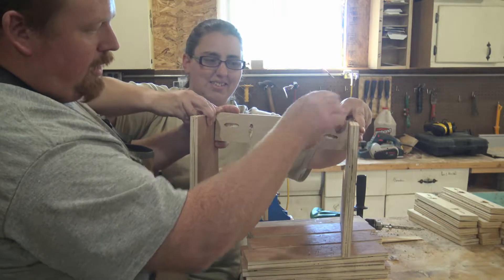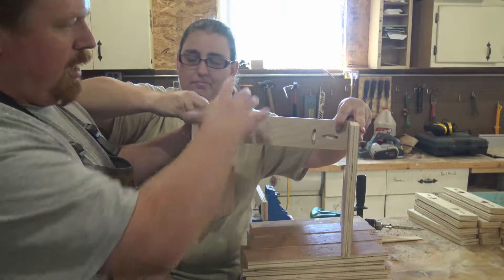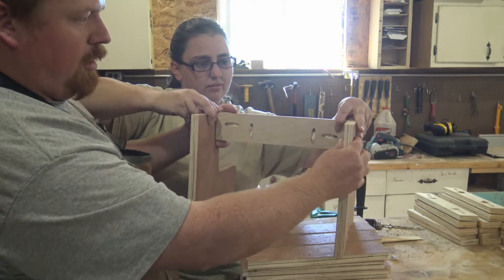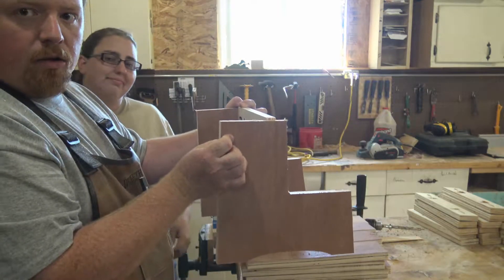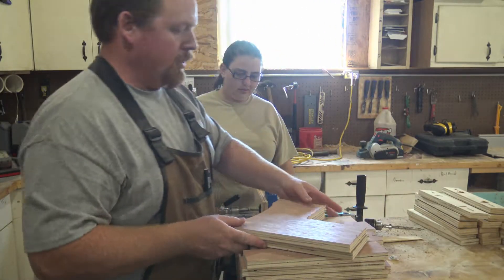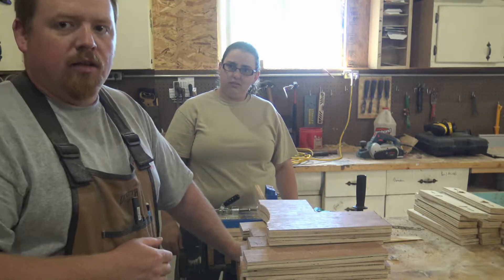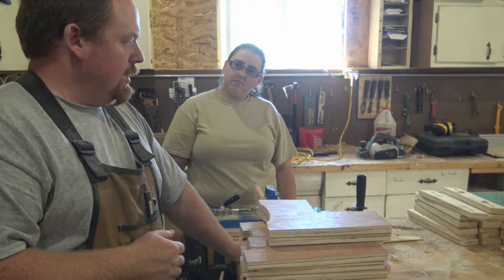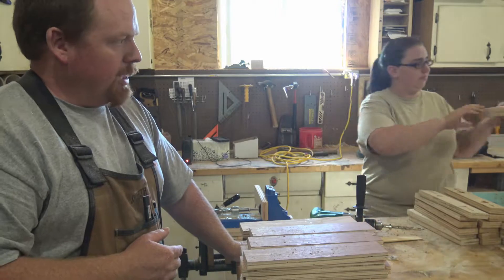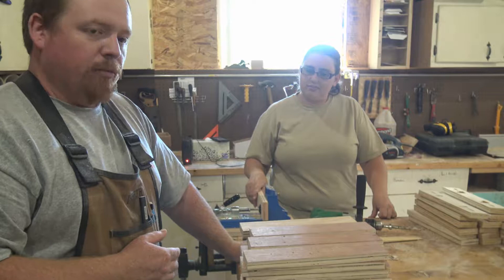With a screw coming in like this, there'll be another one here, and there ends up being four of these braces on each of the stools, with a step on top here and another one down on the second level. So as you can see from the side, it's a nice little two-step stool. The Kreg jig is a nice way to do this — we used to do it with a bracket, but that ended up adding to our cost because we had to buy the bracket, whereas the screw is a lot cheaper. And I think it actually does a better job and makes for a more stable stool, so it's better for everybody.